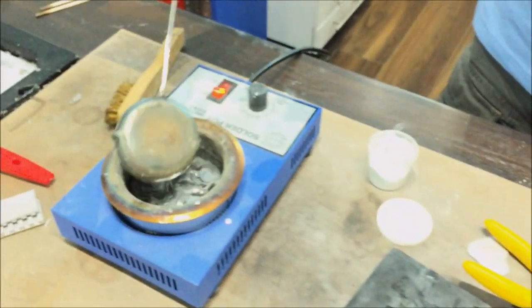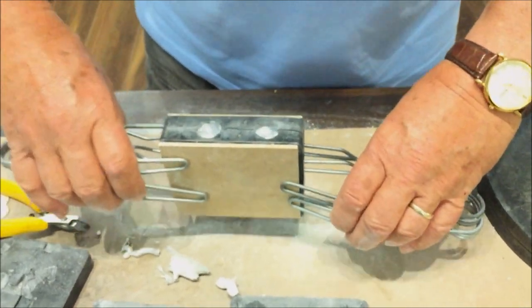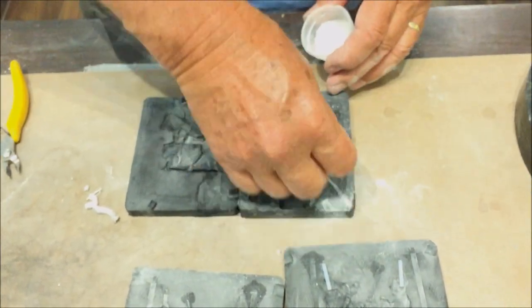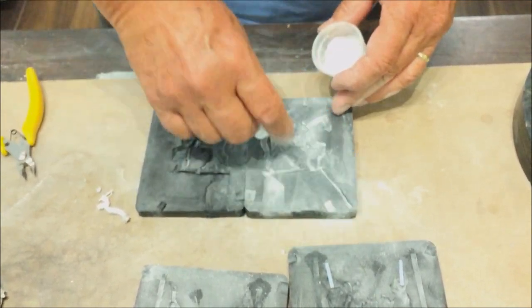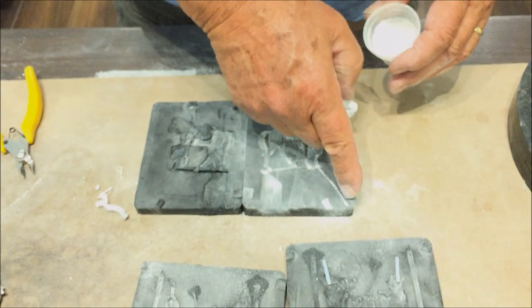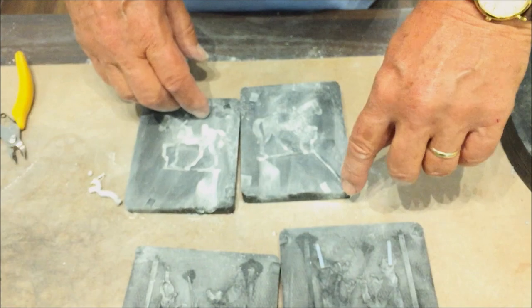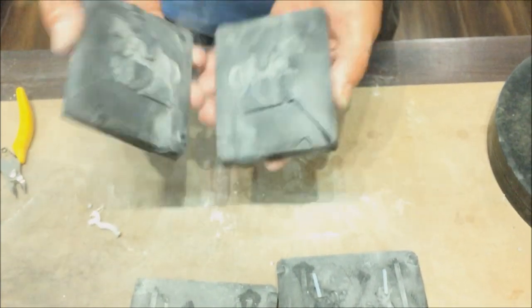Leave that for about five minutes. Next, we will do the horse mold. Apply the release agent powder all over the mold. I added an air vent near the base to help fill out the casting better. Always cut the vent towards the top of the mold to prevent leaks. Clap both sides together again and then assemble it.